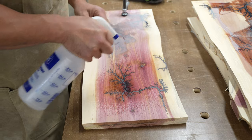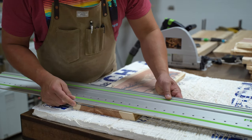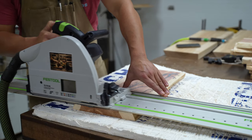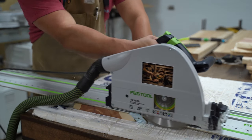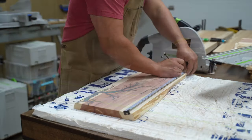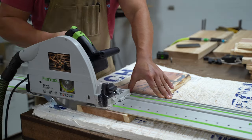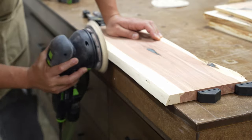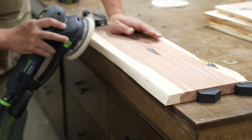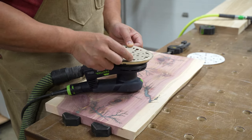A little taste of what this board would look like — so pretty. Here I'm just cleaning up the sides, and I'm also making sure they're parallel. Since most of these edges are pretty rough, I end up using 80 grit, then 120, then 150, then hand sand with 220 later on. For the tops and bottoms, I end up sanding 150, 180, and 220.